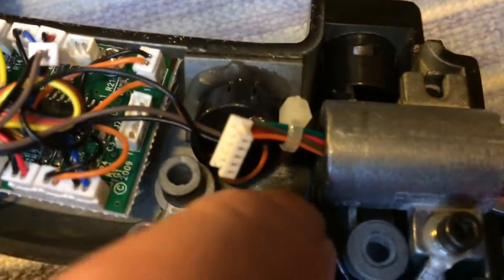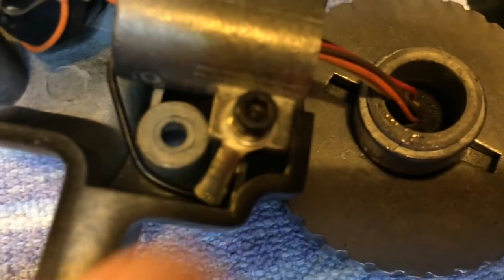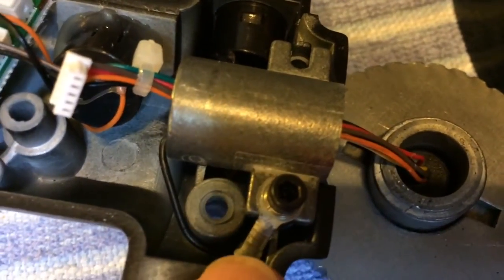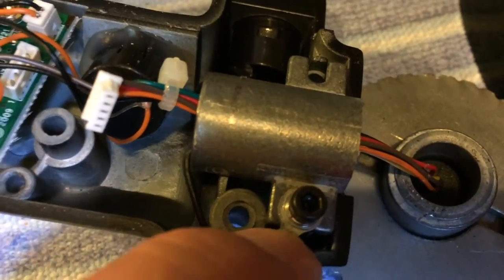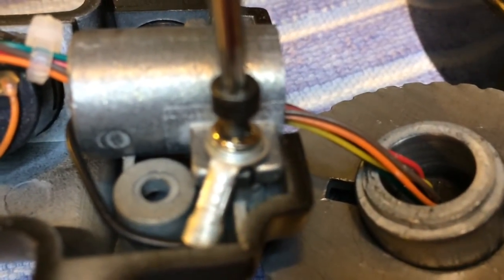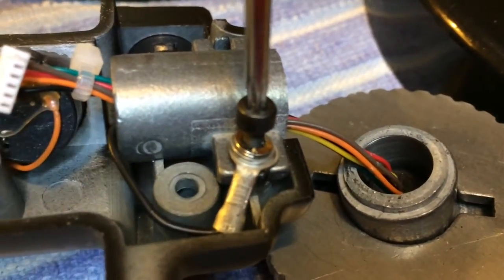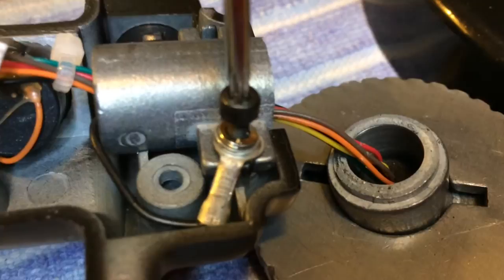Note that we have a little ground strap right here, and there's a black wire that comes around under here. The black wire comes out of here — let's see where it's coming out of the barrel. It attaches right there, but that looks like a screw attachment rather than a weld or solder joint. So this is just an eye terminal and may slide on through too. That's obviously a ground — black is conventionally a ground. Note that there is a split lock washer under this guy, and it appears to be a flat washer underneath it.